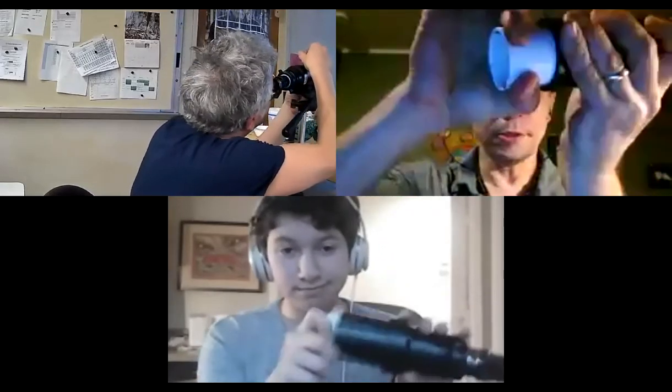And then using sandpaper, how to get the PVC part? Okay. So on the other end of the scope, if you take your objective cell out, it's going to be real stiff, right? Then you're just going to sand the inside of the black part, and there's probably some big bumps in there that can be sanded down. Oh no, sorry, the white part is the part that's stuck. I can't take it out because it's stuck. I get you. You may need to use pliers or a wrench or something, or get help from a strong person. But once you get it out, then you need to do some sanding. We'll let you do that offline so we don't see you struggle.